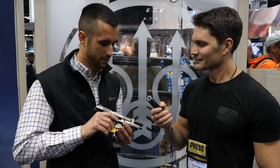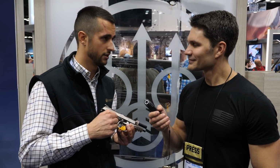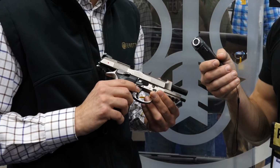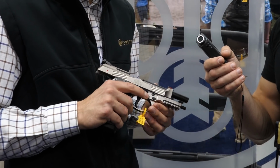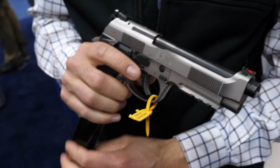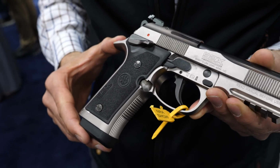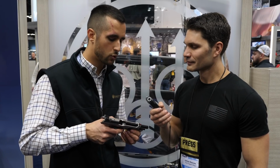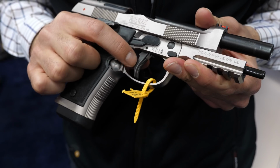So to have a quick overview of this gun, we worked mainly on two main drivers. I would say the weight, the distribution of the weight, and the trigger, because as you know, so far we had only duty triggers, so we were not competitive enough for having a sports shooting gun. So we decided to have a full steel Vertec frame, a Brigadier slide. As you can see, the Brigadier slide is thicker and heavier, and in this way, we reached almost 3 pounds overall weight.